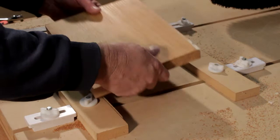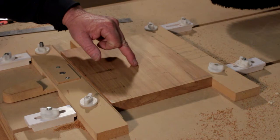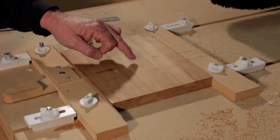So I'll just now brush that away. I can now turn this over, lock it in place, reset the cutter to the lowest point here, which will be about the center here, and then I can tell it that lowest point is half a millimetre, and it will machine this entire board down and machine away half a millimetre at the lowest point, giving me the thickest possible board out of this.